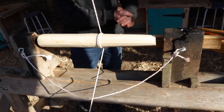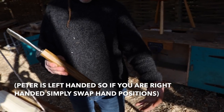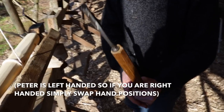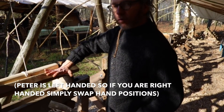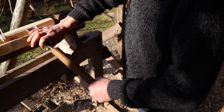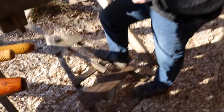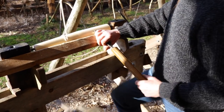Now we need the tools — we're going to use the gouge, the big gouge. I'm left-handed so I hold the end of the chisel with my dominant left hand; if you're right-handed, hold it the other way. My other hand rests on the tool rest — that gives you a positive feel. The back hand pushes the chisel forward and back to get the right angle. If the treadle is in the wrong place, just move it until it feels comfortable. Try and get a nice push all the way up and down — you don't want little pushes, and you don't want to come so far up that the string goes loose. Just keep a nice bit of tension.